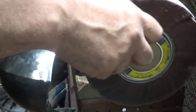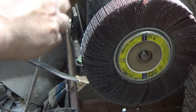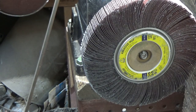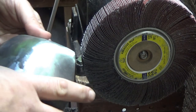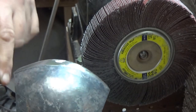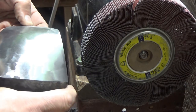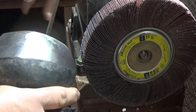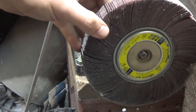This is a flap wheel - basically lots of bits of sandpaper at various grits. This one is 80 grit, same as the disc was. I can go at this more gently now. I was as gentle as I could be over there with the grinder, just touching it across, removing the scale, revealing the dents and dinks, and then tapping those out. I'm pretty happy with the way this is. I'm just concentrating on this side, giving it a clean up - not too aggressively, because this can really chew through.